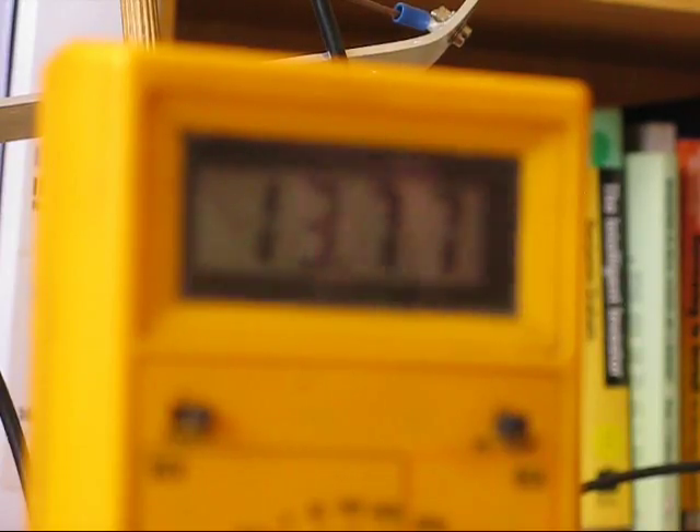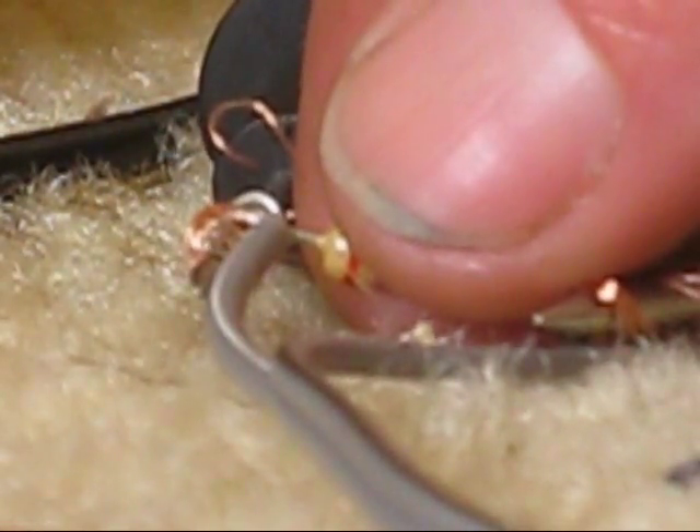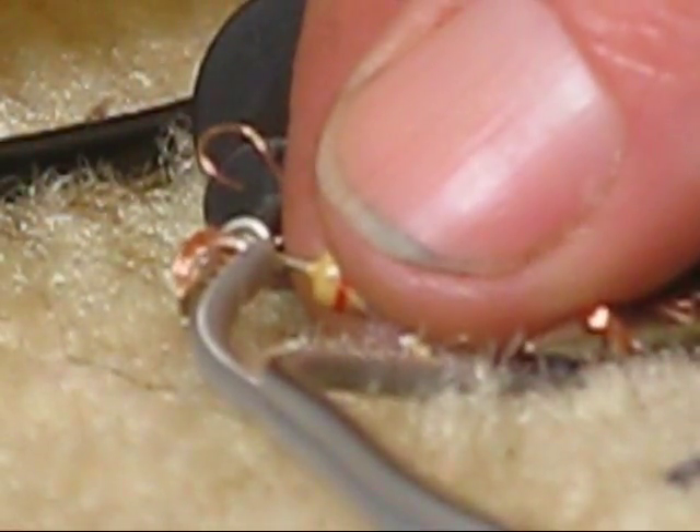With 270 ohms, we're getting around 13.8 or 14 volts. If I crank really quick, it can get to over 16. Even after a few seconds of winding, this half-watt resistor is too hot to touch. So we know this thing really is putting out appreciable power.